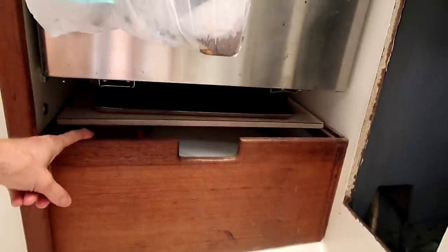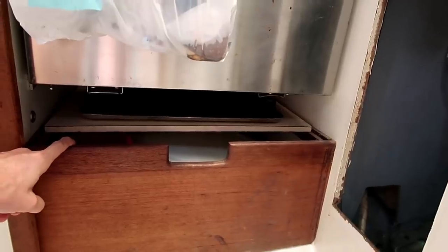But then there's a hose that goes from the propane locker to the stove, which, if there was a leak in the hose, it would go into the bilge. But then, if there was a leak behind the stove, it would basically fill up this area that's beneath the stove. So I'm kind of torn on where to put the propane alarm. But I think the safest logic is to put it in the place where there's the biggest chance of an open flame, and obviously that's the stove.